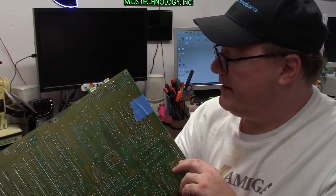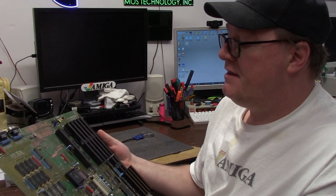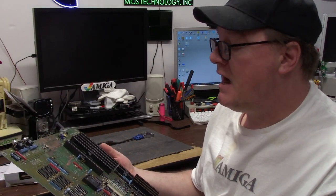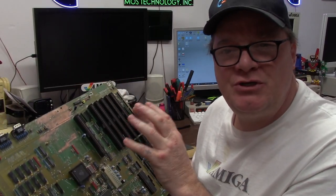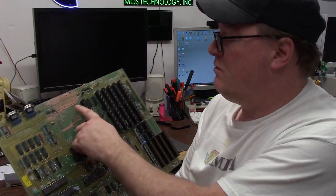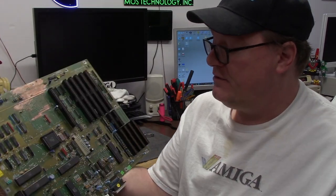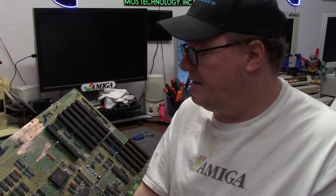So this is the Queen Mary, I guess, and the blue tape is optional. I'll call this one the Queen Mary. Why? Because she's gilded with gold. I don't know if this was battery damage, but we're going to go with the similar shade of a yellowish pea soup green for solder mask when we're completed. We have the whole VCC bus exposed as well as the ground plane and RTC. The sockets were just removed and I need to check a couple of the vias because they were lost in the removal of the ROM socket.